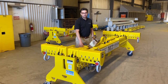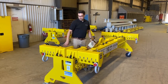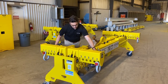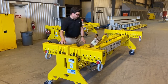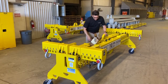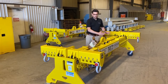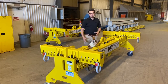What we have here is a 4-point adjustable lifting beam with a 10-ton capacity. This lifting beam is adjustable in many different ways. Firstly, we have the cross members that we can rig from — they're adjustable not only in their lifting points along the cross member, but also along the beam itself. This is the same at both ends. The lifting bale is also adjustable along the length of the beam, powered by a hand chain and acme screw that allows the operator to move the bale to help center the load, keep the center of gravity below the lifting bale, and keep the load balanced.